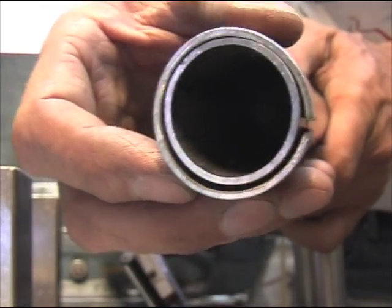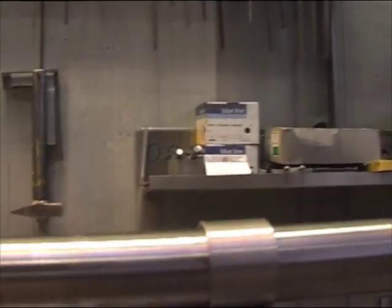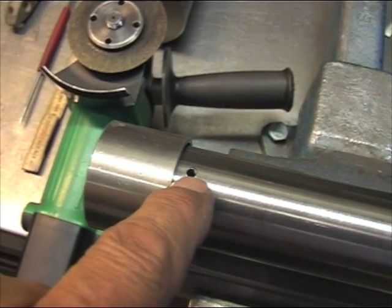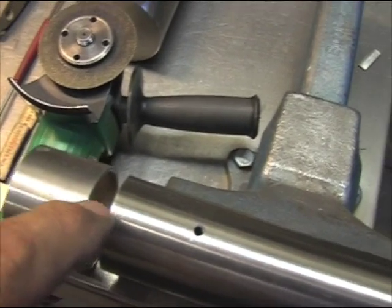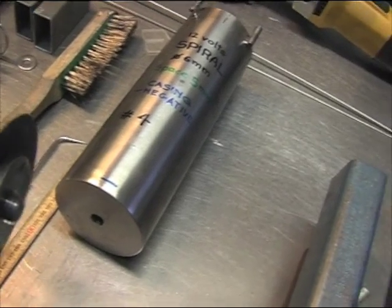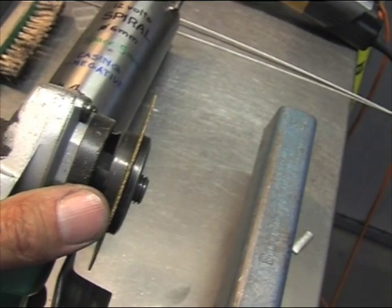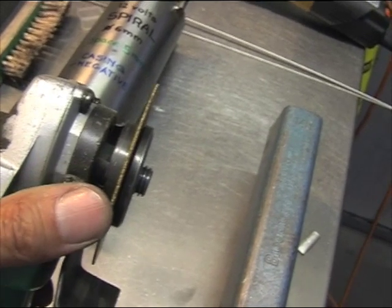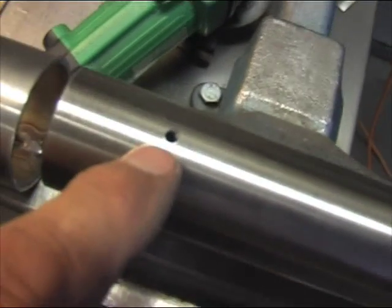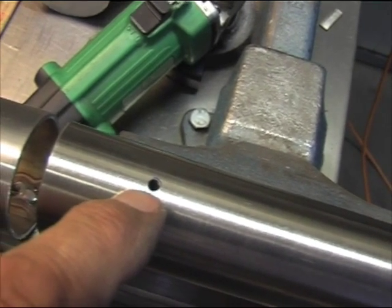You have a very tight fit, and what's important is that you have enough room in between so you can go through with the wire. Now I have drilled a hole here — about a little more than 1/8th of an inch. To cut it open towards the end, I suggest you use a little machine like this with a grinding blade. This blade is very thin — 1/24th of an inch — it's extremely good to cut because it doesn't overheat. Whenever you work with stainless steel and you have to drill holes in it, remember you need to cut in half the drilling velocity.